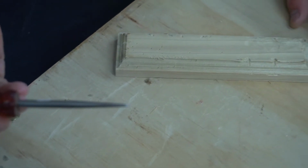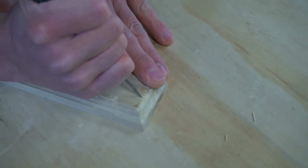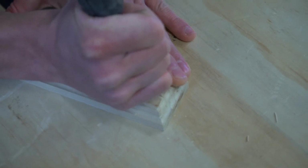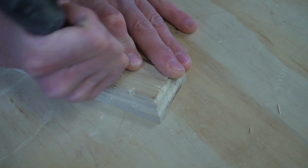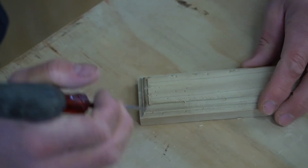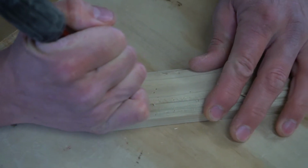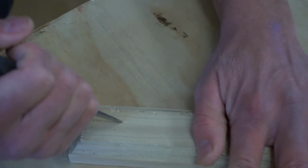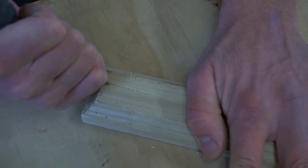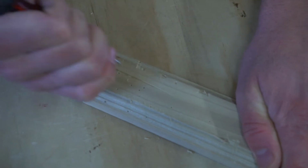The other thing I like to do with this awl, and it's incredibly versatile, like I said, is to put an actual crack in it. So this will look like a crack in the wood. This is where alder, poplar's not bad either. It's soft, but alder and pine, those softwoods, are so much more friendly when you're distressing. So what I want to do when I'm putting this crack in is put more pressure the further I go towards the edge, because most cracks, when they develop on the edge, will be deeper on the edge portion than the middle. So I'll use very light pressure here, and as I come back, I put more and more pressure on it.